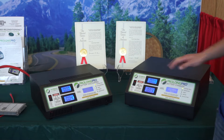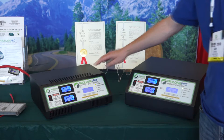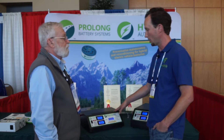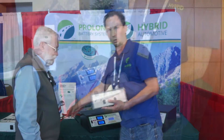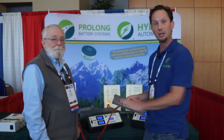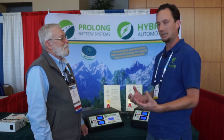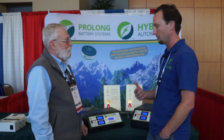A quick highlight: the charger and discharger are designed to be used on a complete battery as an assembly to cycle it and recover capacity. One of the neat features of the discharger is it has individual module testing capabilities — it can connect to a single module and evaluate the health of that module, identify failed cells or failed modules, replace them, and then cycle the battery as a unit.